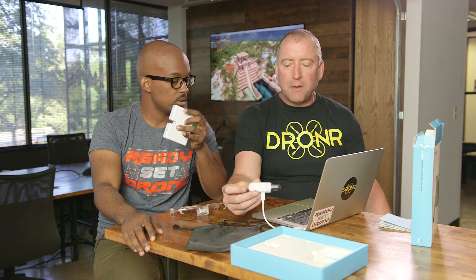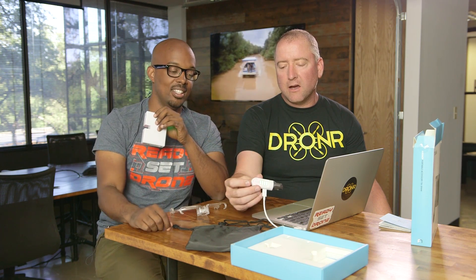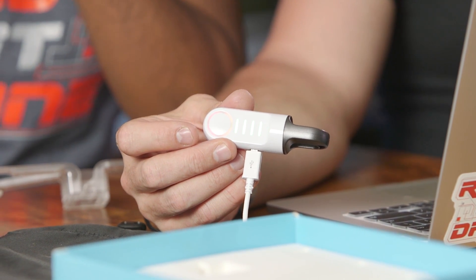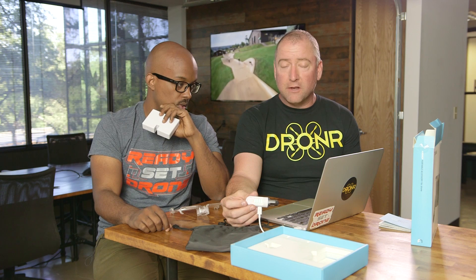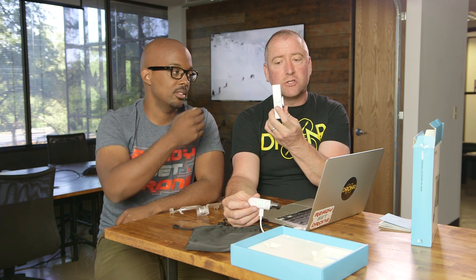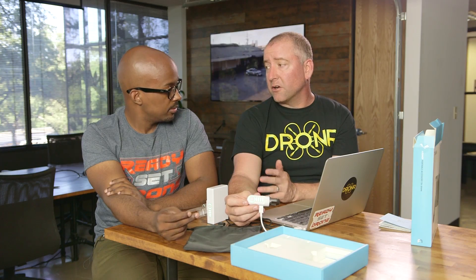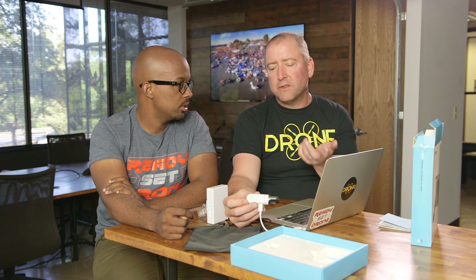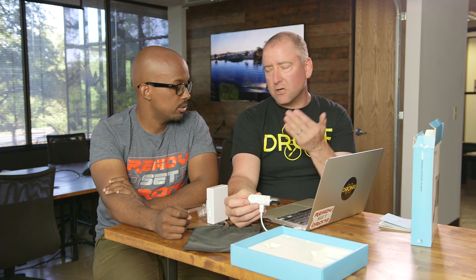The battery life on this remote is not great — as you can see, we've got it plugged in right now. I had a full charge but let it sit for about two weeks without recharging. The unit itself is fine though — charged two weeks ago and still showing four bars. The point is: number one, the remote doesn't seem to last too long. Number two, unlike DJI's intelligent batteries, I wouldn't fully trust these battery bar indicators — it showed three bars and then was dead in about 15 minutes. If you're going to use it the next day, charge it the night before. It only takes 90 minutes for a full charge.